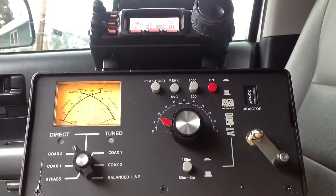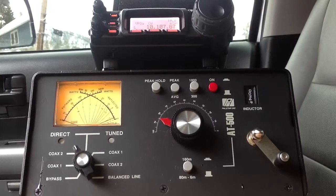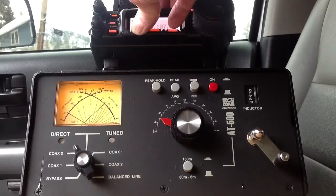Now let's go to the direct ATAS — about the same noise level. I have not conducted a head-to-head contest between these two antennas on this band. But I did do it on 30 meters. Now we've got to retune it, so let's go ahead and do that. See if I can do this without getting in the way of the meter for you. It'll take a little longer now to find its setting because the frequency is a much greater departure.